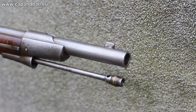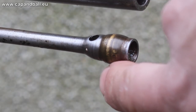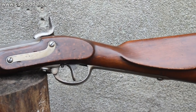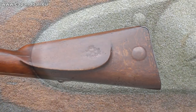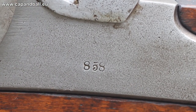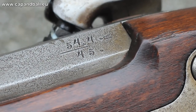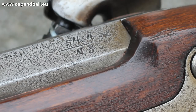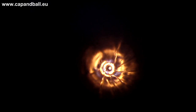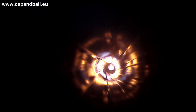The 947mm barrel is held in place by three bands. The weight of the rifle is 4.1kg. The ramrod has a brass tip to save the rifling from damage. The stock has a cheek piece, which makes the rifle comfortable even by today's standards. The lock is marked with the imperial eagle, showing that this gun belonged to the Habsburg army. The three digits on the plate mark the year of production. The double F on the barrel tells us the rifle was manufactured by Ferdinand Frühwirt. The numbers on the left side of the bore are unit markings: 54th regiment, 4th battalion, 45th soldier. The condition of the bore is not perfect but suitable for shooting — I would say it is around 95% okay. The rifling has 4 grooves and 4 lands of equal size. The grooves are 1 point, or 0.18mm deep. The twist rate is one complete turn in 2 meters.